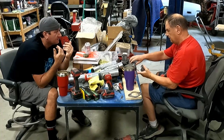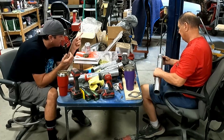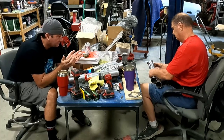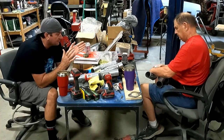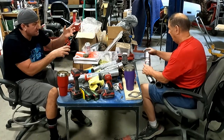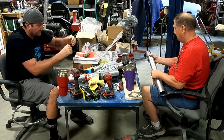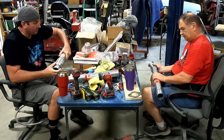Well, the guy said $75 an hour, it would take them probably a couple hours to connect the exhaust manifold to the X pipe. So, we can play around and we can try to hack all this in, but what I'm telling you is I don't think you're getting the concept. We're not using flanges and we're not stacking teacups or Dixie cups inside each other. It's going to be welded solid one piece to the other. I'm not talking about it being welded like this. Solid. And yes, we weld around that.